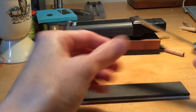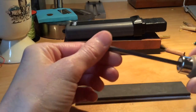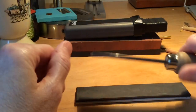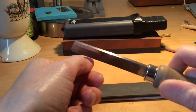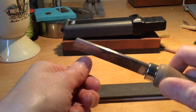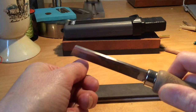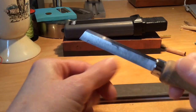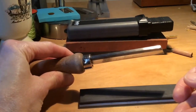Here's what I do. I have a really simple three-step sharpening process. I'm right-handed so I'm going to be talking about the scraping edge, which is this one facing away from me, and the non-scraping edge, which is this one. I don't care if that edge is sharp or not — you see I'm scraping backwards and getting nothing. That's because I only want it to be sharp this way. If you're a lefty, obviously you'll just reverse in your mind everything that I'm showing you.